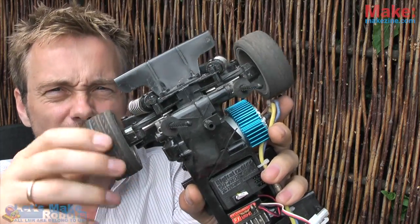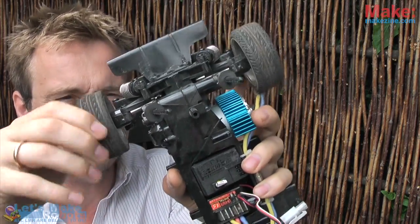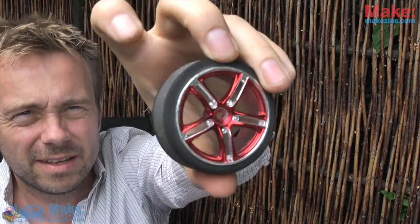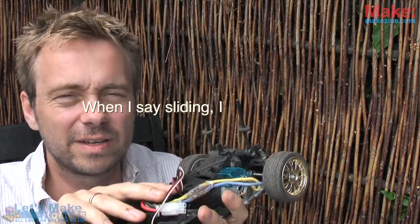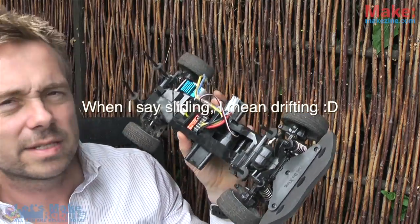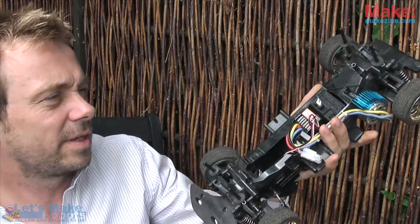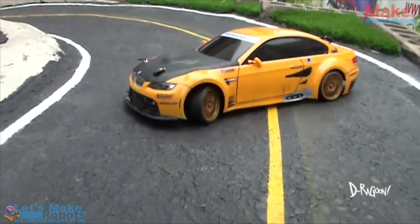You can lock the differential drive so it always drags both wheels at the same time and speed. You can get these hard tires, which means the car is really just sliding around rather than truly driving. The problem is that instead of sliding around in corners, it'll start spinning and completely oversteer. But you can just let the microcontroller handle that.